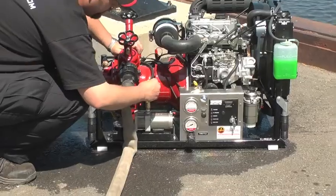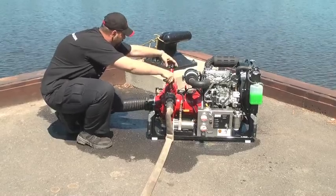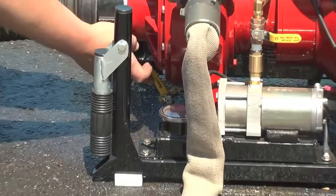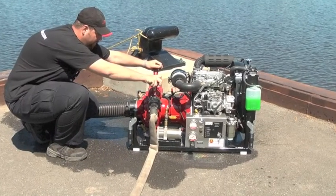When you have finished pumping, reduce the throttle, stop the engine, and open the drain valve along with the discharge valves. When you want to store the pump, be sure the pump is drained and keep all the valves, drains, and discharges half open.